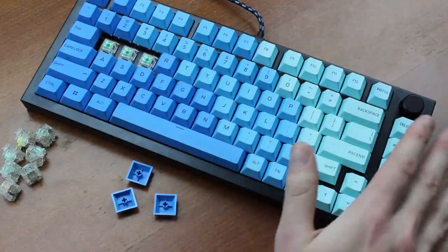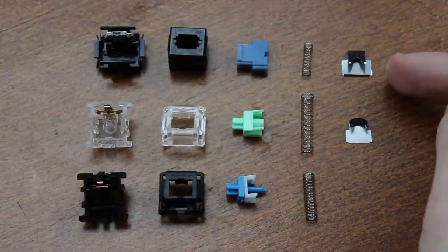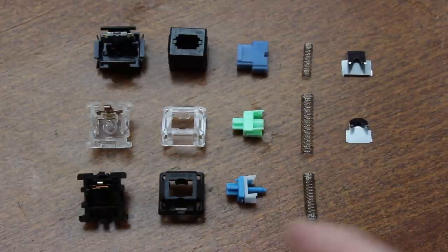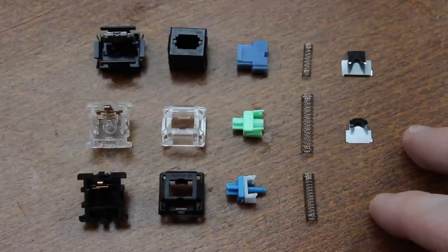This just happens to be a good host for them. So let's start with the background: the Clickies switches are essentially a hybrid between Alps and Cherry switches, by taking an Alps SKCM style click leaf and sticking it in a Cherry MX style housing. This would theoretically allow one to get the feel of Alps switches while maintaining the compatibility of Cherry MX switches. Note that compatibility in this context is specifically things like keycap mount, pinout, plate profile, etc.